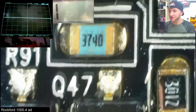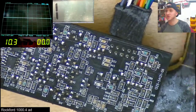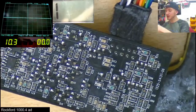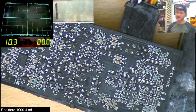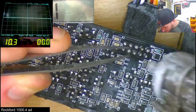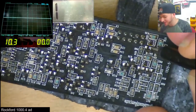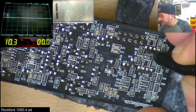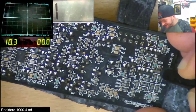They're just labeled 4F and 2F — they're different as well. We've got 17.49, 32, negative 39 on the good one. The only real main differences between these two are pin 3 and pin 6. Since I had voltage differences on these six-pin chips as well, it was time to remove them just like the op-amps. Finally, after so many hours of tracing, removing these tiny chips gave me complete equilibrium between these two cards — there were no more voltage differences between these two cards anywhere.